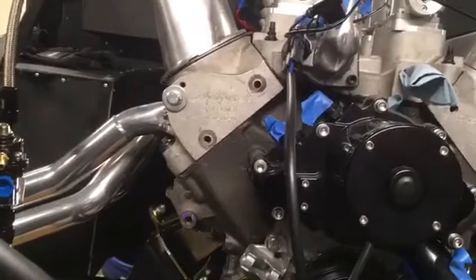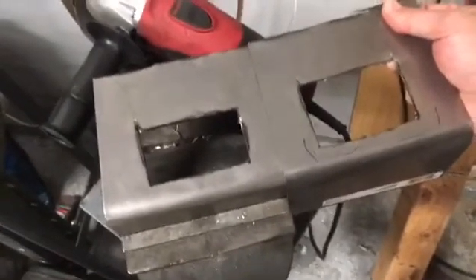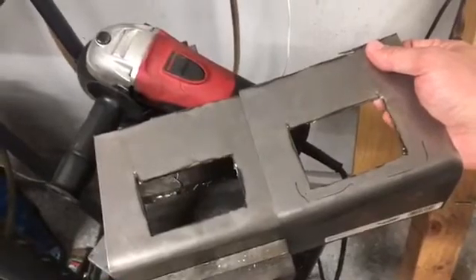I need to drill holes for all three mounting points in the bracket. After cutting the holes, you can see the coil fits. There's a little bit sticking out underneath that I'll take the grinder to. On my first bracket I got my measurement off — the hole on the right is significantly bigger than the hole on the left. The coil still fits, it just wiggles back and forth a little bit, but once I drill the mounting holes it'll stop doing that. I'll keep the coil biased towards the back side.